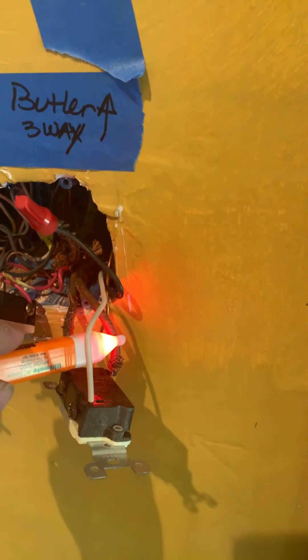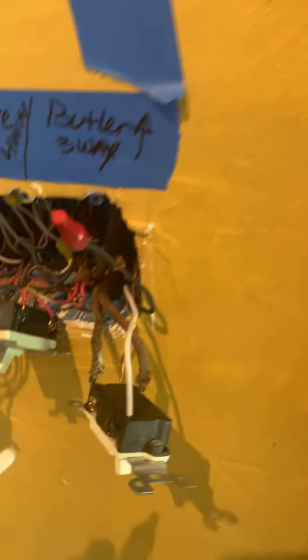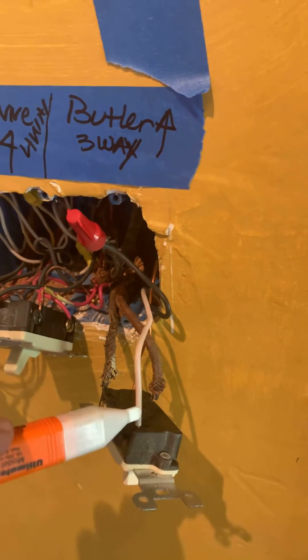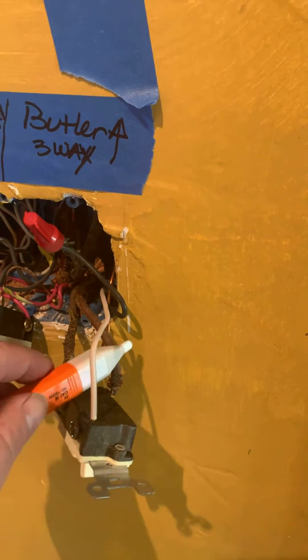Look — if I turn this on, watch. Now we're going to go back to this. There's no power here anymore. The reason there's no power is because you're completing the load on the neutral circuit here. The power is still here. Now if I turn this off, there goes that power again. The reason this load disappears is because that neutral line is now connected — you're completing the circuit. The load of that light fixture is on that switch.